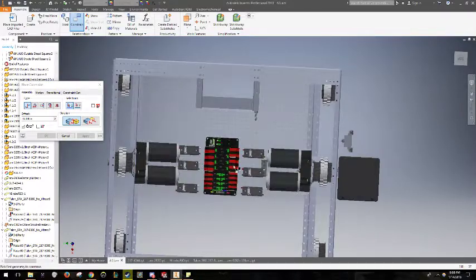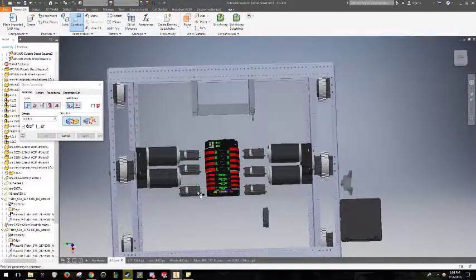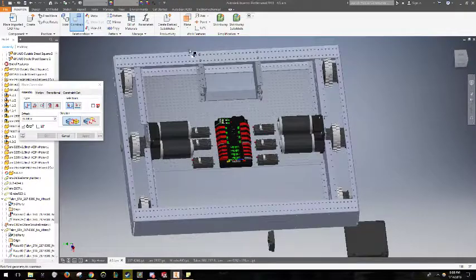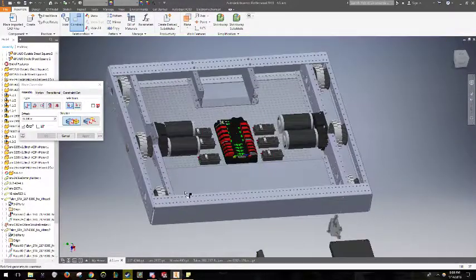Now you see I have this PDP mostly flanked by the talons that we're going to be using. There's a talon per motor controller, there's a talon per motor. We have four motors, which means four talons, and these other talons will go to other mechanisms, such as a lift mechanism, or a climbing mechanism, or an intake mechanism.